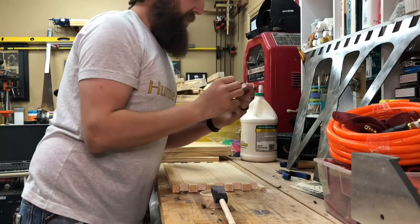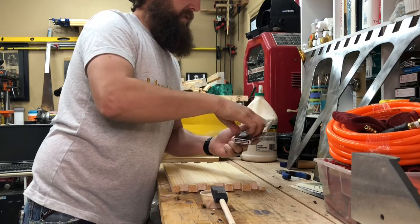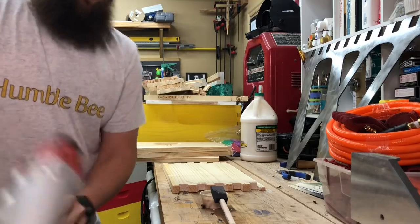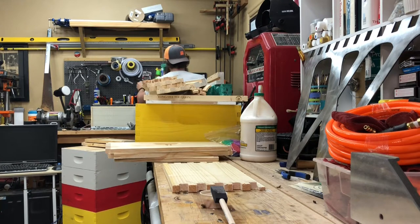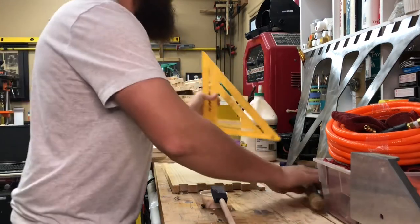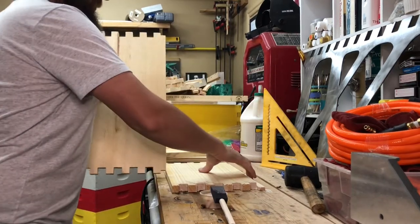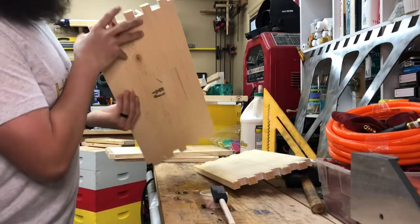Let's see what size brads I'm going to use — I'm going to use these one-and-a-half inch guys. Also Harbor Freight brads, which seem to do fine. As long as you keep these things oiled. A couple of additional tools you're probably going to need: a mallet and a speed square to make sure you're square. I'm getting glue everywhere. When you get liberal with the glue, you're probably going to make a mess.